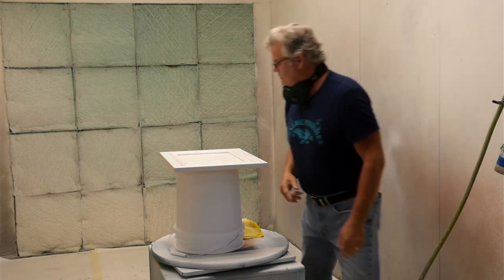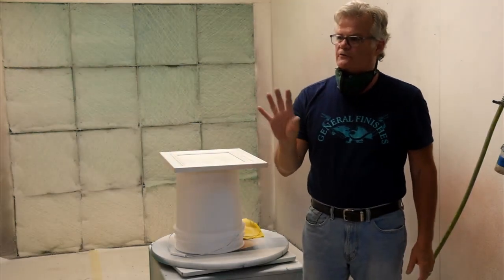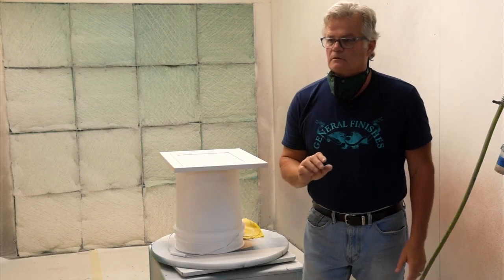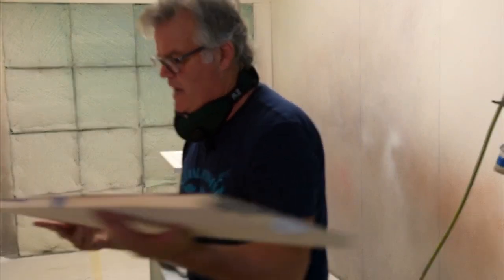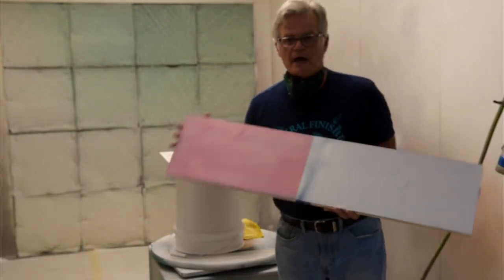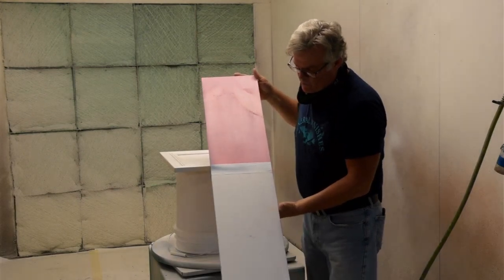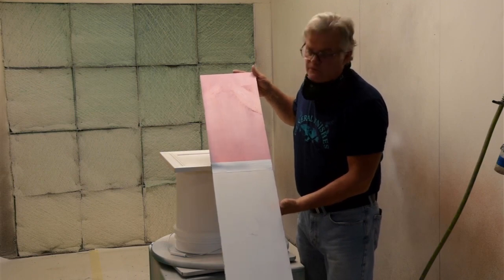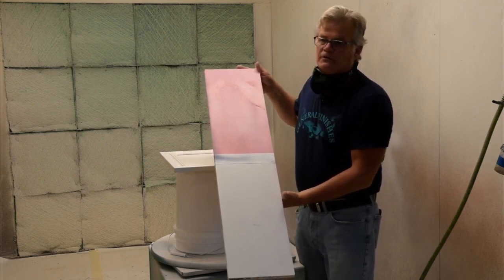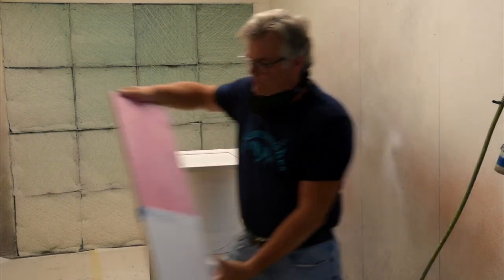test. That board that I had with the red dye on it, the short one, Chris, is there a small one there? There we go. This is the red dye test. So everything we made, we put it over red dye. And out of all of them, the only one in water-based that outperformed the shellac and the oil was the stain blocker. Okay? You see it? That worked good? So we tested everything over red Merlot dye.